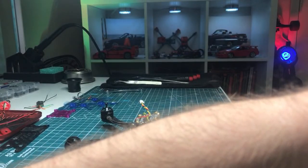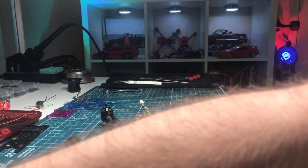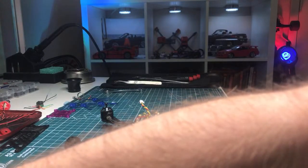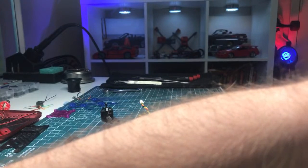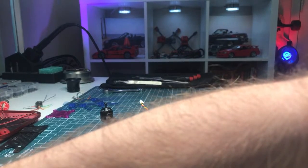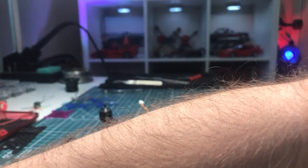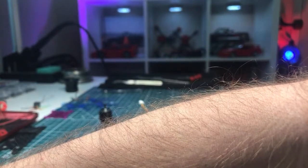1700 kV, 2306 motors, great for 6S. I hope so, Nabi. I have a couple of those stators coming to do that with my F40 Pro IIs. I think it is. That's the equivalent of 2400 kV 4S, which is kind of my sweet spot. It's not huge power, but it's huge throttle resolution, and it's enough power. I think just all the power in the world makes flying these things so much harder. And for me, I just end up in the clouds waiting to come down for half of my battery. So I prefer to have a little bit less power, which 2400 kV 4S or 1700 kV 6S is exactly that. So that is my preferred KV. And motor size, 2306. I really like that motor size.